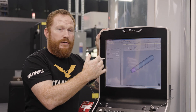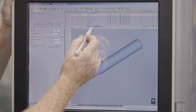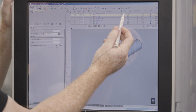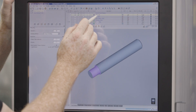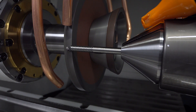For each tool path we have various options for speeds and feeds and cutting direction — that's all going to be located underneath in these little tabs. The first one, this little clock icon, I have my RP or reposition, my approach, my liftoff, and rapid retract. This peel OD is going to kind of just peel back the circumference, the tip of our tool — it's going to be the first operation we're going to utilize.